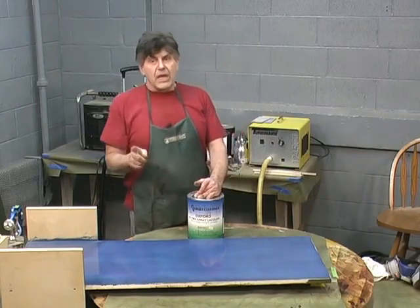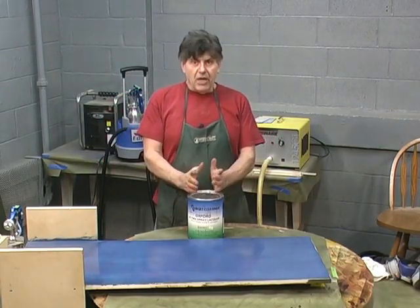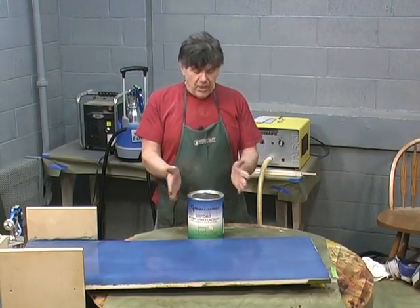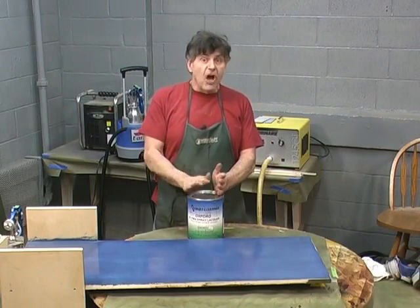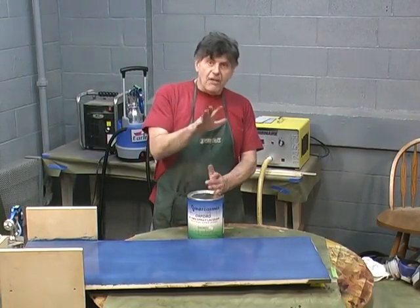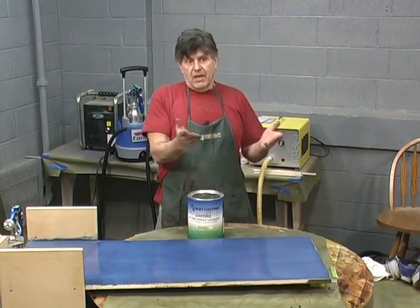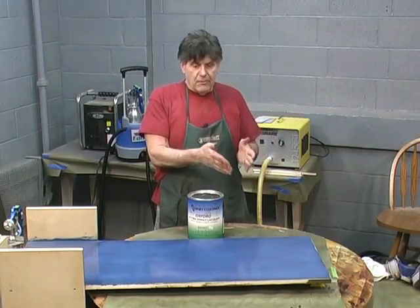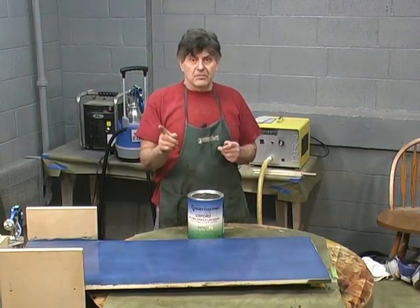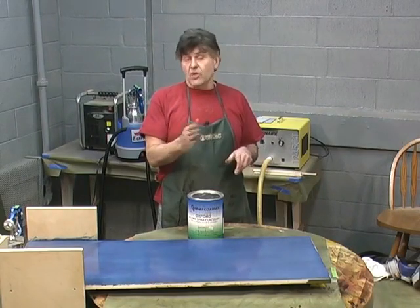When you put MEK into a bucket of solvents or a bucket of resins and it dissolves them, that's a solvent. The solvent is what dissolves whatever's in the bucket. Example, shellac. Alcohol becomes the solvent. It dissolves it. It's also the thinner.